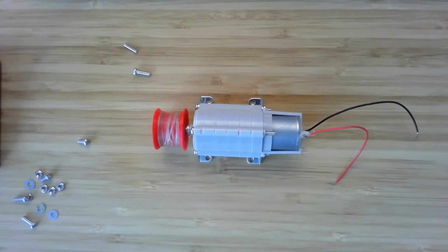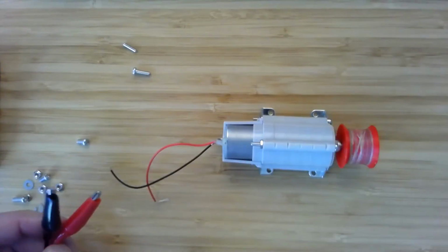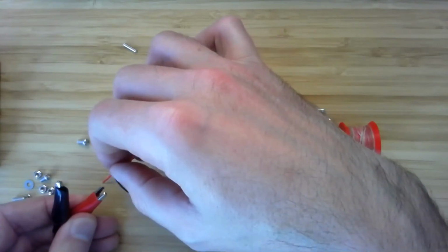All right, the other thing to do here would be take my power supply, turn it on, and set it to the nominal voltage of 4.5 volts, manufacturer specifications, and I think this should just barely reach it. And then we'll connect one lead over here.